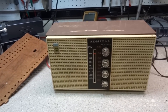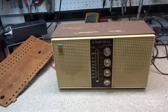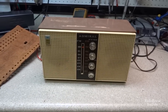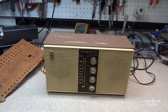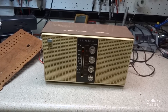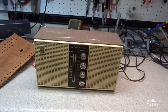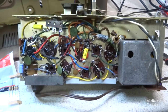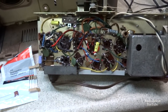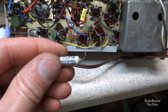FM's back, it doesn't sound too bad. I'm going to go through here and check it a little bit more, see if there's anything obvious that doesn't seem kosher about it. I don't know what happened to the tube or why it snapped like it did — could have been somebody in the radio who bumped it. So I took it apart and got it opened up, and I've got a couple of these caps — I'm going to go ahead and change some of these coupling caps with these old Japanese capacitors.